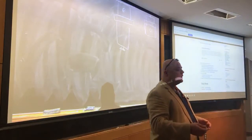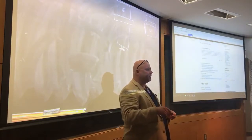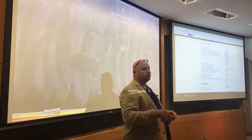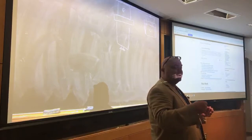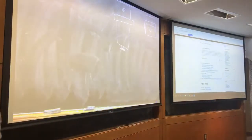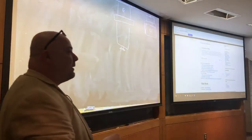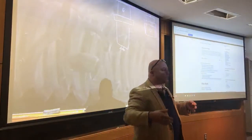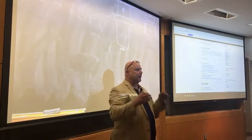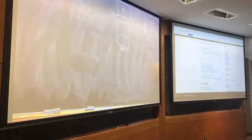Then we're going to assume that all of that power goes into the cutting force that's going to push it in a direction that's going to move. In reality, not all of it's going to go that direction. Some of it's going to be pushing it against the vise jaw, while some of it's trying to push it along the vise jaw, right? In reality, it's never going to be all lined up in the bad direction, but we assume when we do this model that it is. So we can estimate the power.